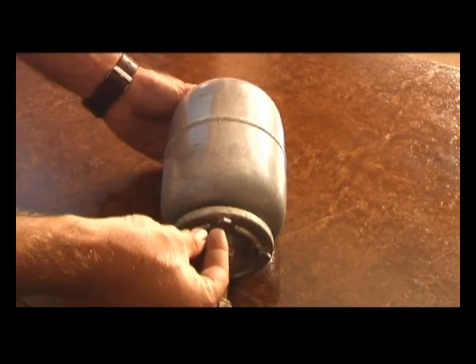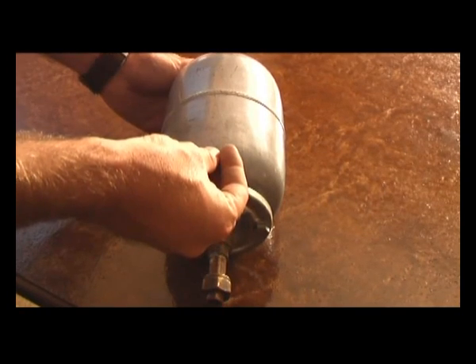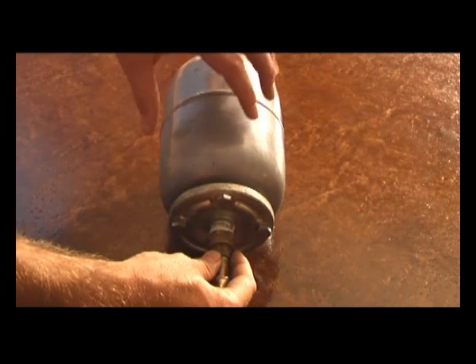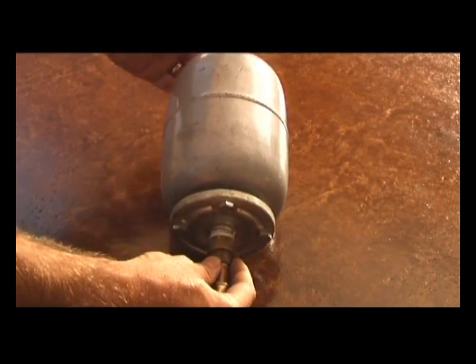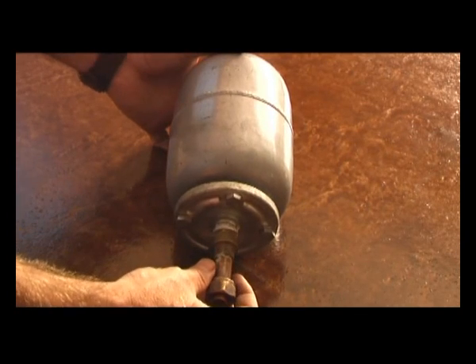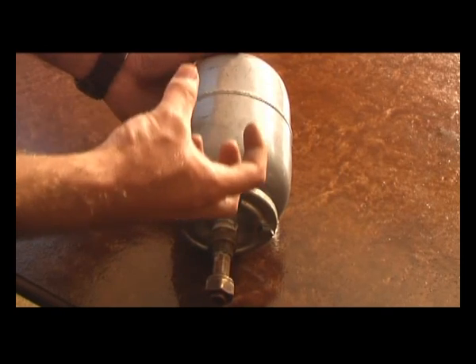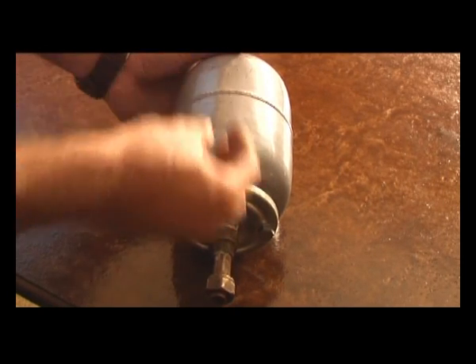On an indirect system, an expansion vessel is needed, as the glycol or antifreeze solution expands and the heat exchanger and the collector will not be able to take the pressure. There's a bladder inside of this vessel and between the vessel and the bladder we have compressed air. When the antifreeze or glycol is heated up, it expands, giving a cushion, and when it cools down at night, it's released back into the system.